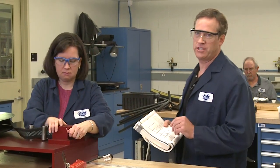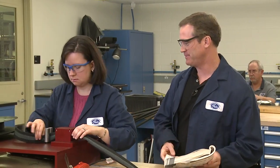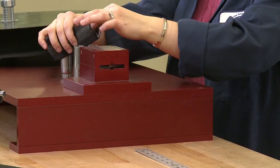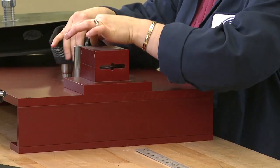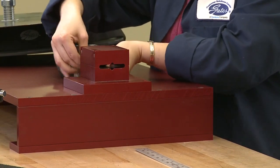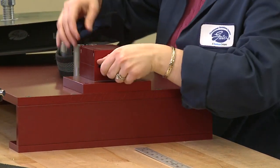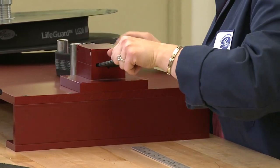To begin the assembly of the Lifeguard sleeve, you must first determine the proper length. This information can be found in the Gates assembly specification. Next, you'll need to route the sleeve through the guide table. It's important to use the guide table because it opens up the sleeve and holds it in the correct position for cutting and sealing of the sleeve in one step using a hot knife.